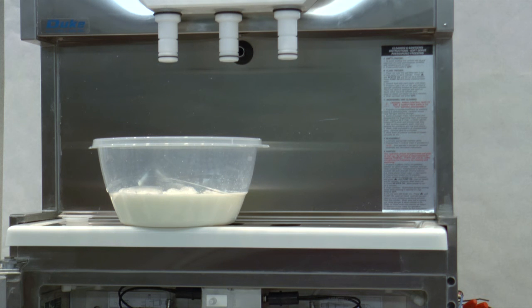If you're in the freeze mode, it'll again trip the pump low PSI, shut down the affected pump, but allow the cylinder to stay in freeze mode. To reset it in freeze mode, you have to turn the main power switch off and back on, and then you can turn the machine back to freeze and it'll continue operation.